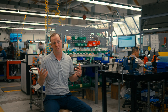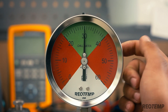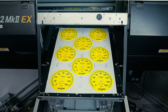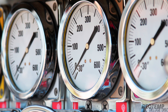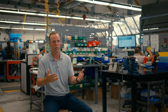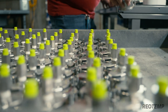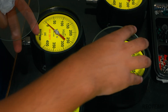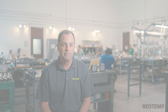The same thing goes for process identifiers — put the service right on the dial. Have a gauge that indicates a hydrocarbon application and make it a high-vis, while the other gauges can be white because they're just utilities. Make the gauge work for you in the situation that you're installing it in. So why do we make pressure gauges? Because we can make them more useful and more functional. And ultimately, we hope that leads in a small part to making work safer and more reliable. We hope our customers will let us do that. Thank you.